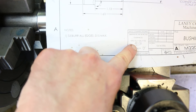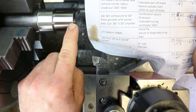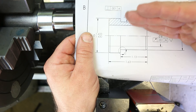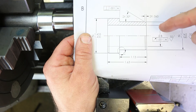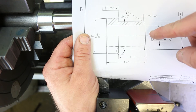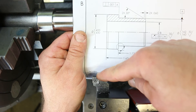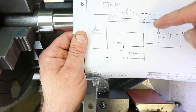The next step, step number 16, is to cut the 60 thousandths by 30 degree chamfer on the end of the part. Looking at how this is called out — the 30 degree angle is called out 30 degrees from the center axis of the part, and the 60 thousandths is along the axis of the part from the far right end to the left. We're not going to do this with a chamfer tool — we're going to use the same turning tool with the compound set up to 30 degrees and cut it that way. This is just like what we do to cut a dead center in the chuck on the threaded shaft project.